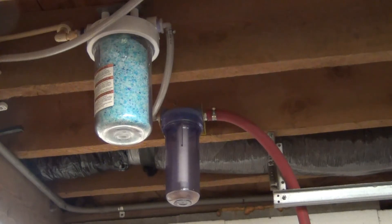These housings are tested at 300 PSI — three times the maximum operating pressure — for 15 minutes without leaking. They don't say anything about taking them to a burst pressure, but they have to hold 300 PSI for 15 minutes. They also have to be tested at 150 PSI for 100,000 cycles — dropping the pressure slightly and bringing it back up to 150 — without leaking.